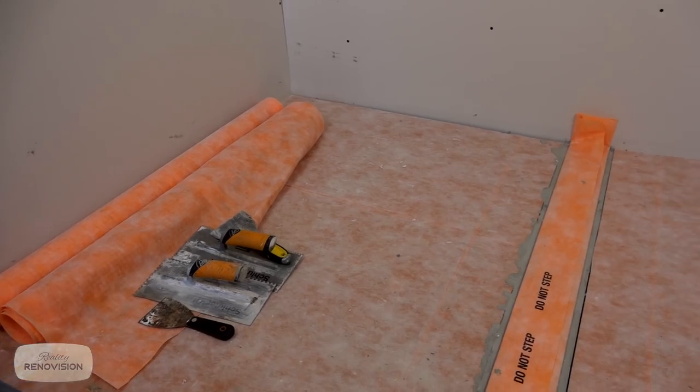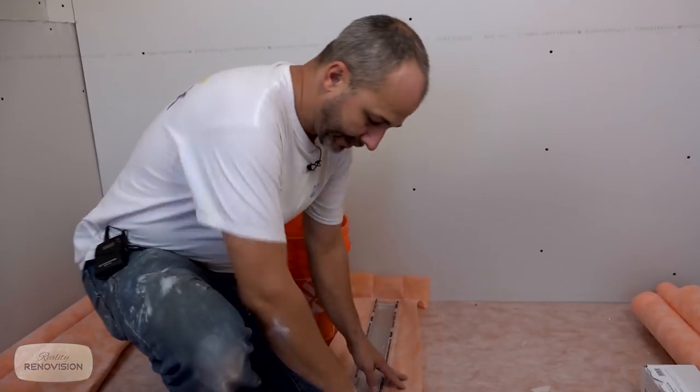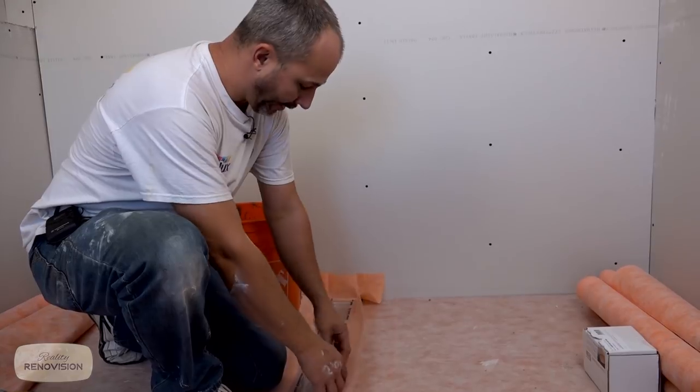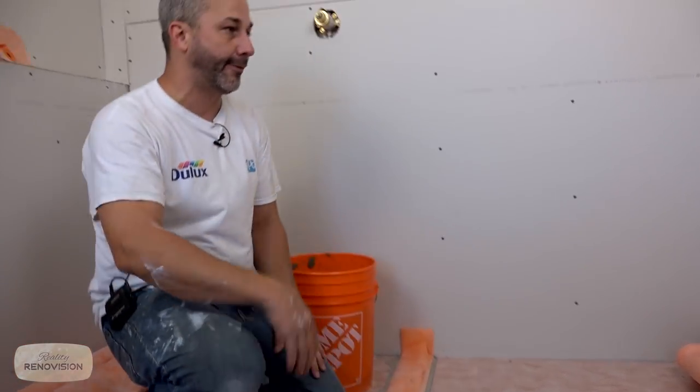Welcome back to our barrier-free shower. We are about midway through the project right now. We've got all of our drywall on, our last coat of taping is finished, we have all of our mechanical finished, and our shower pan is installed. We've got two separate pans that slope down to the middle, and this is where our drain goes. We're going to use the kind of drain where the insert has the same cloth on it so that it can receive a tile — when we're done tiling you'll only see a grout line without grout, and the water will rush down the pan into the drain. What we're going to do today is finish off all of our waterproofing so we're ready to sand, prime, and paint before we tile. I like to do that first — if you put the tile down first you've got to do all kinds of site protection to keep everything clean.